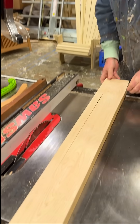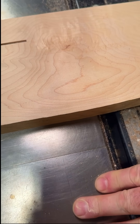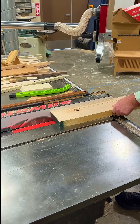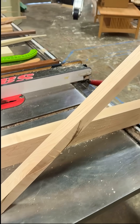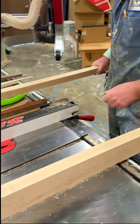You can see just how much that's pinching. I have a riving knife in place to hold that kerf open, but once we get to this point, it's still way too tight in this area. So I'm going to flip the board over and finish this cut from the opposite side — and you might see it pop. I'll just shut it off right there. Not bad — this piece actually stayed fairly straight even with all the stress that's inside it.